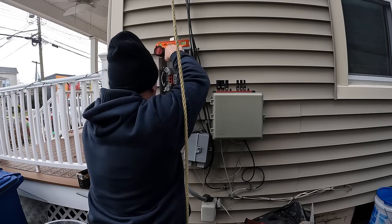It's important to get this right and to just take your time and inch up to it so you don't accidentally cut the conductor too short. If you do that, then all the work you just did as far as attaching the service riser to the house really all has to be redone. You're not going to put a splice in here. And 4-aught aluminum is not exactly super flexible. So be very calculating here on how you proceed and take your time to do it right. Usually it should take you about an hour or less to terminate all of the conductors inside the meter.